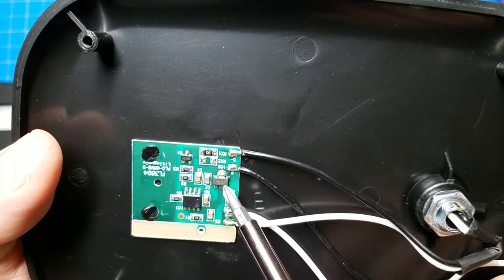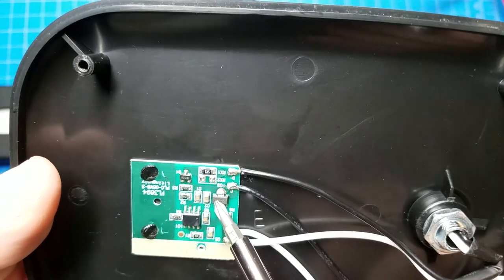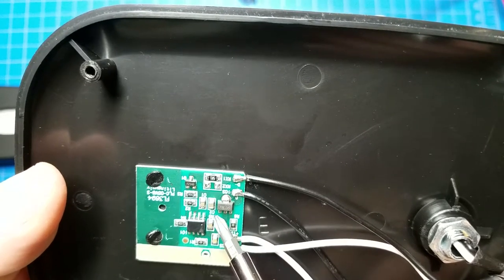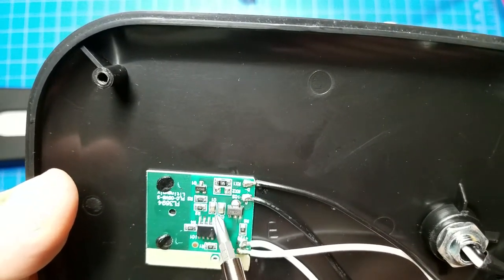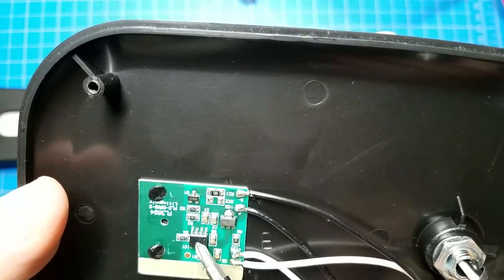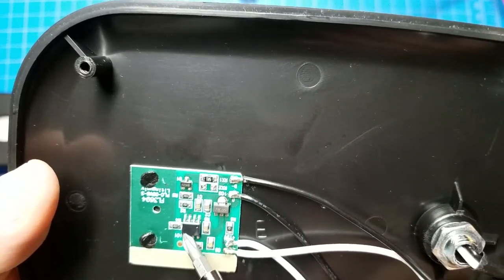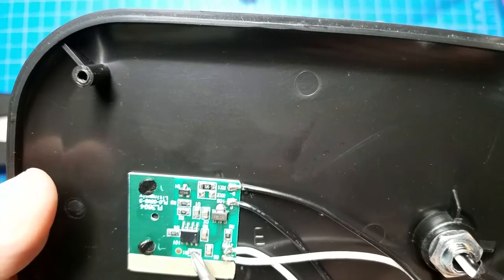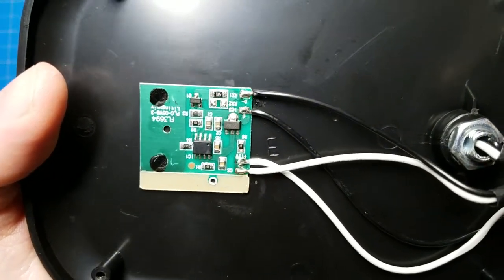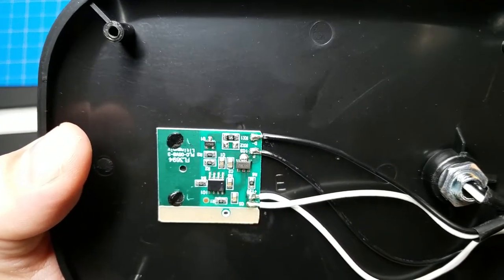into here, and that's converting the 13 volts down to 5 volts. The middle pin's ground, the 5 volts would be coming out here. Yeah, there's a couple capacitors across to ground, sure, to smooth it out, and that goes into pin 3 of that microcontroller, which is going to be power. So pin 3 is power, pin 6 is ground. We could probably figure out what microcontroller that is, because that's somewhat non-standard organization. Anyways, that's all that's down there.